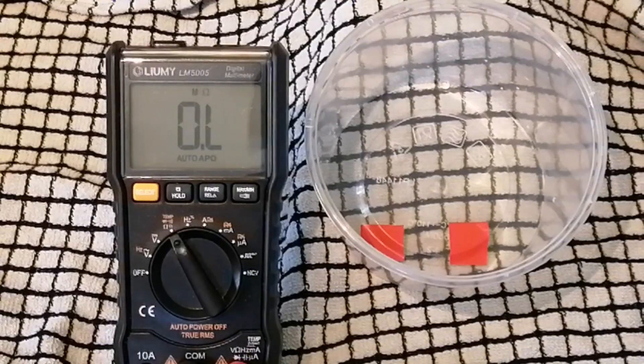If you send RF over plain ordinary water — a large body of water like a swimming pool or a freshwater lake — you will get some slight increase in RF distance, but this will be marginal. As soon as that water becomes salty, the resistance of that water drops dramatically, and I'm going to show you a little experiment to demonstrate that.